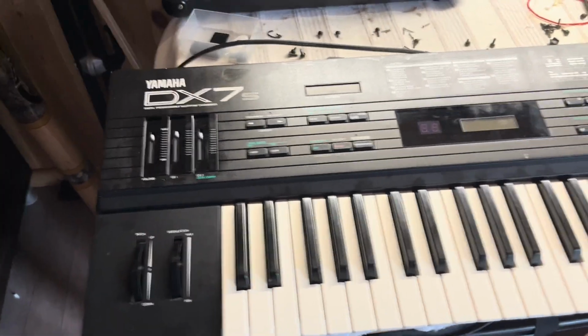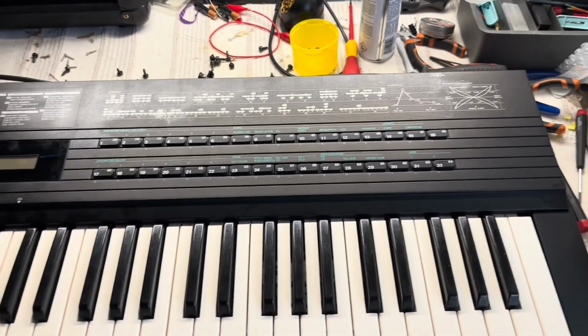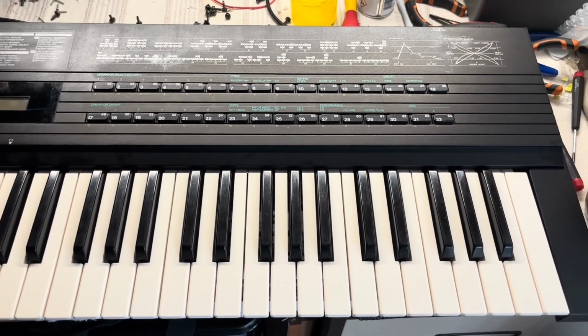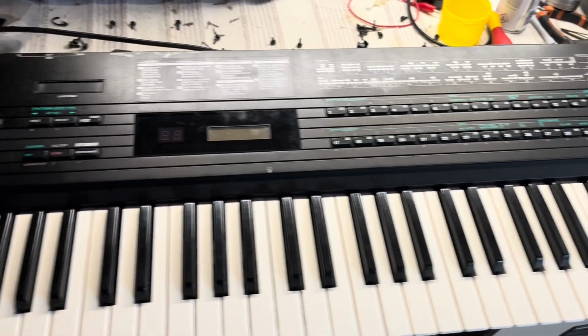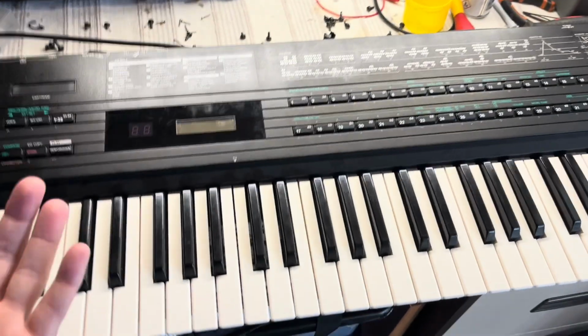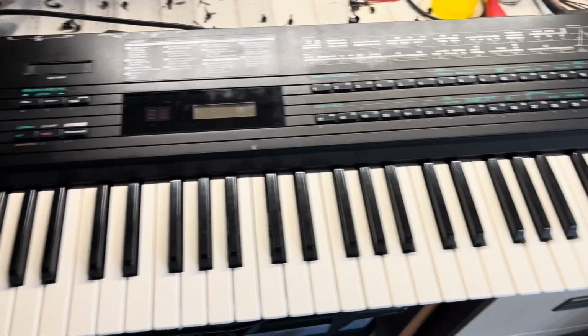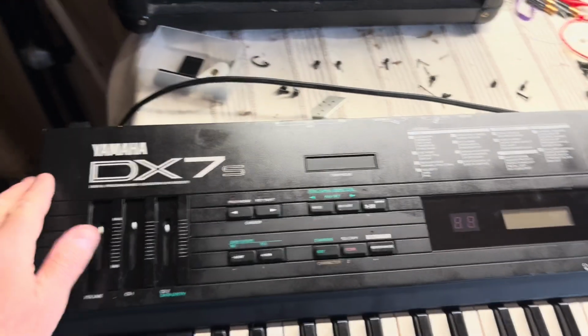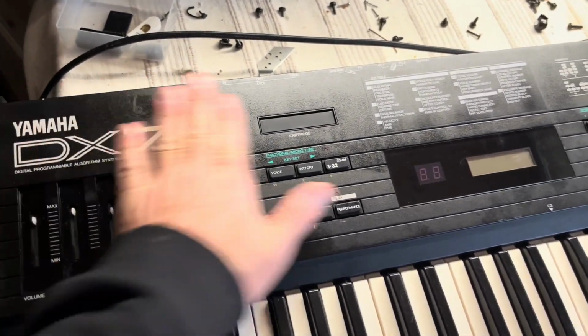So we're all back together then functionally, so a lot of the PCB screws aren't in, in case I have to take them out, and obviously the base isn't on yet, so I can get to things underneath. I've just turned it on upside down to set the -12 +12 voltages using the little trim pot in there, so that's fine now, that's reading okay. It's cleaned up quite well.